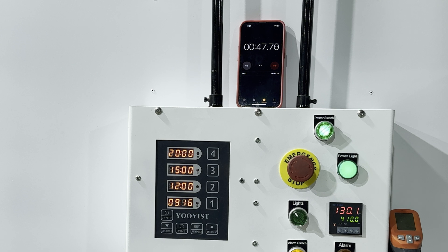We have this set to go to 410. The way we have this PID set up, it's configured to overshoot by 10 degrees and not come back on until it falls to 400. So it should run until it gets to 420, then turn the heater off. We'll carry a little bit of heat after it turns off — I expect it to probably stop around 426 by the time it's done reading.